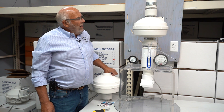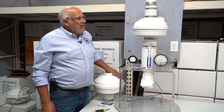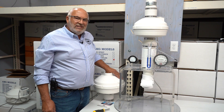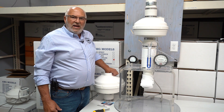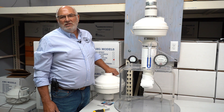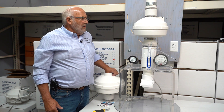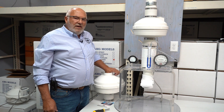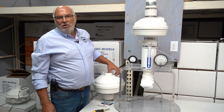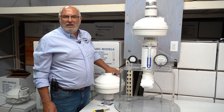To talk a little bit about boosting: a booster fan is used sometimes when you're building a large stack, and the fan just has so much vertical stack to push that putting a booster on top of it is a valuable asset to help the first fan out. It's really simple — it's not rocket science. It's a radon fan, but any fan in this world, if you can't get it to blow far enough, you add another one to it.